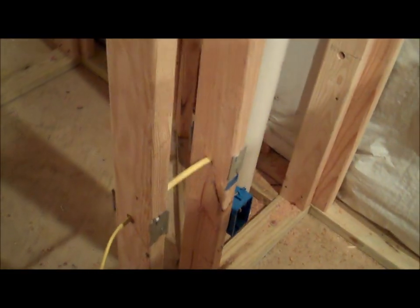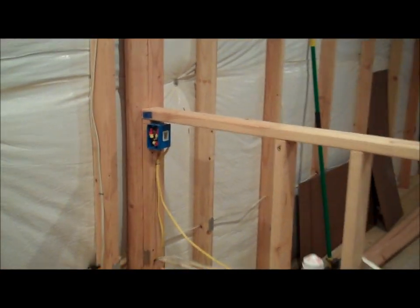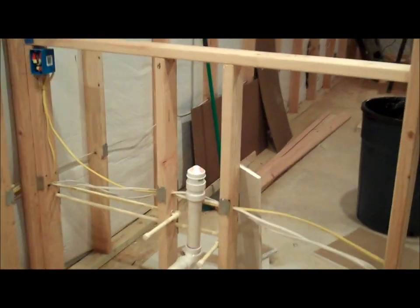There are a lot of wires run up here — I think I'm up to about 1,300 feet of wire run, last I knew. There are some more switches. This is the dedicated outlet for the microwave — it's the yellow wire, which is a 20-amp wire, as opposed to the white which is 15-amp. Down there is the fridge outlet, same deal: 20 amps because it's a fridge, and you can see the yellow wire there as well.